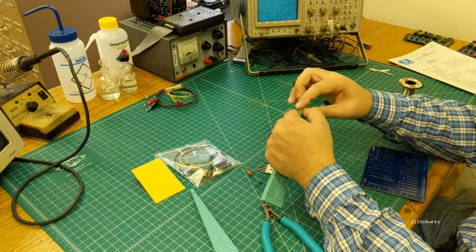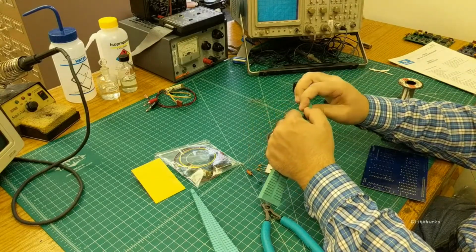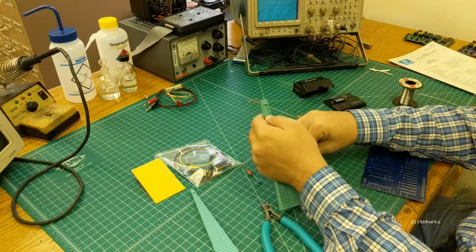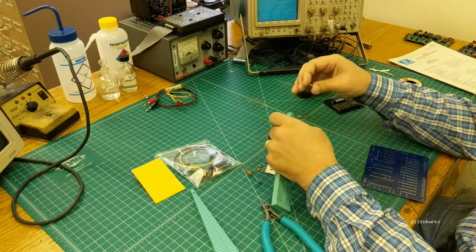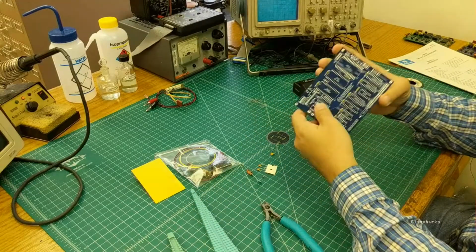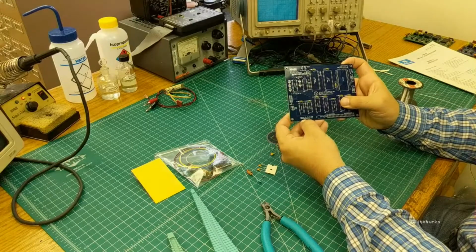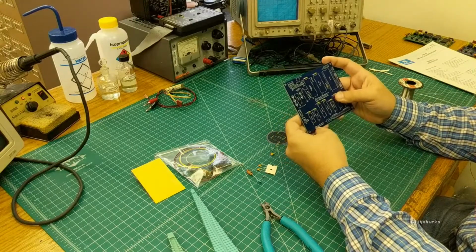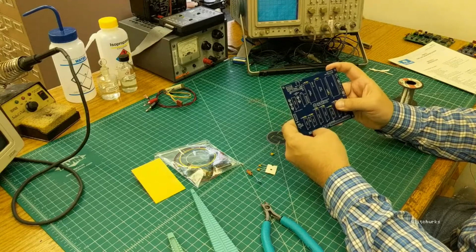Now there's other resistors we won't be installing on this kit because we're shipping R65X1Qs. If you're building this with your own parts and you have a R6511Q, then you need to add those other 4 resistors. And that's covered in the manual. It's also mentioned right here on the silk screen. So we're going to avoid installing R1, R2, R3, and R6.